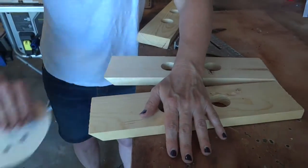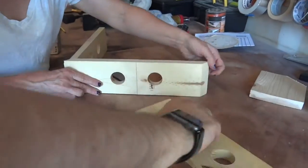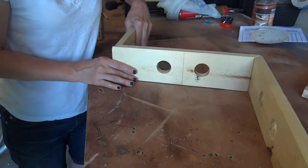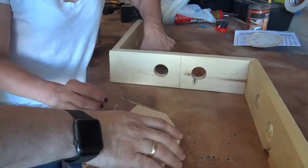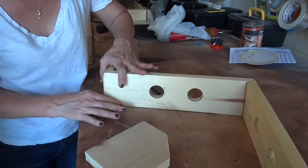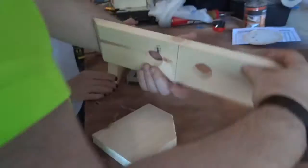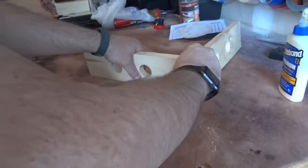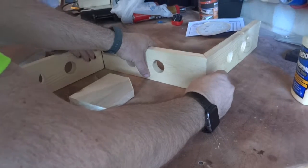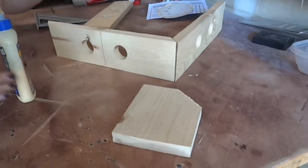So in this stage we're just using a hand process to do some of the cleaning up of the wood, and here we are doing the assembly. Again, I've used this process in other videos. Here we simply check if by rotating the pieces we get a better fit, and sometimes that is the case. We're using dimensional lumber here, we're not using finished lumber, and sometimes you will be amazed that by rotating your materials, you're going to actually get a much better fit. And we're having pretty good corners right here.